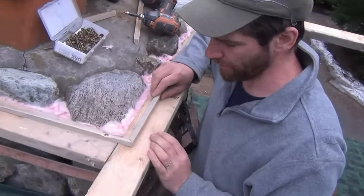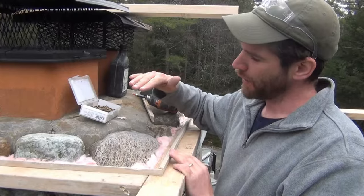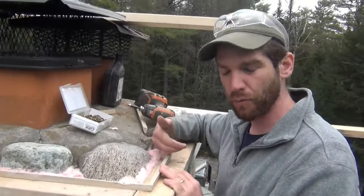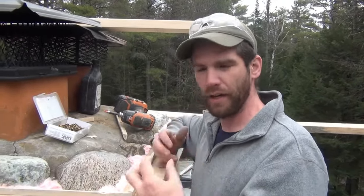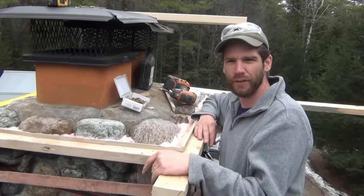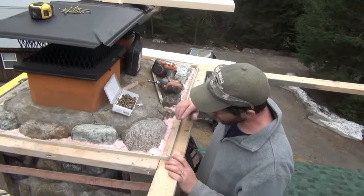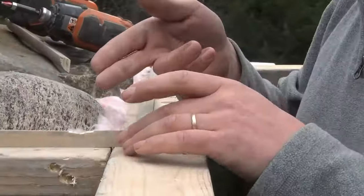This is the drip channel. In the real world, water can flow uphill — strangely enough. If water on this cap comes off, instead of dripping loose it can capillary back and then start running either up under the stones or running in sheets down the masonry. Any of that water application is going to deteriorate over time. It doesn't seem like it should do a whole lot of damage in one rain, but every rain for years — especially if it's acidic — can do a lot of damage.